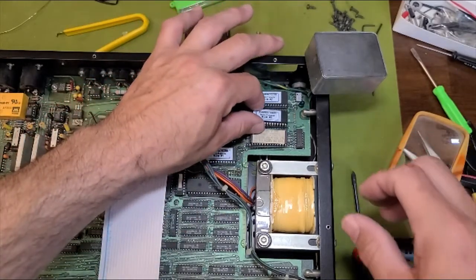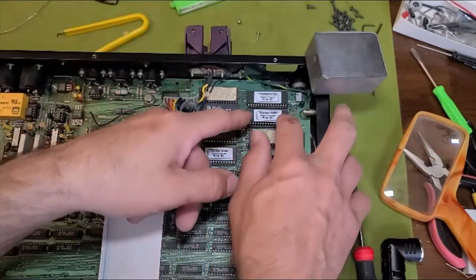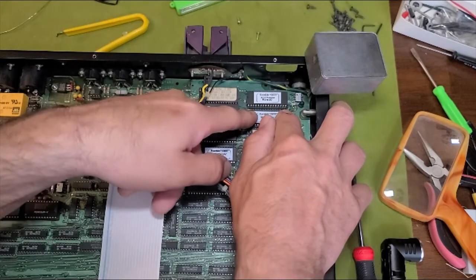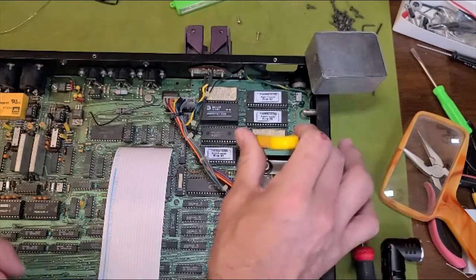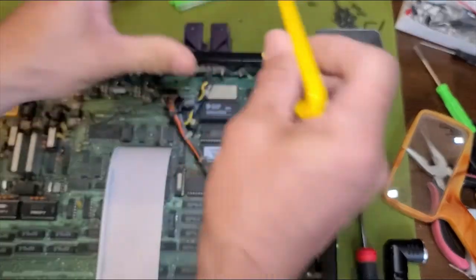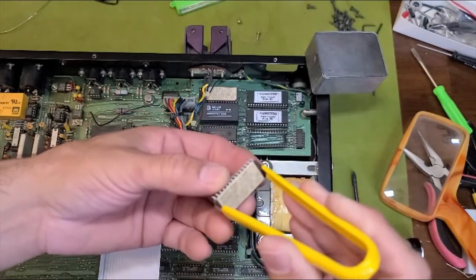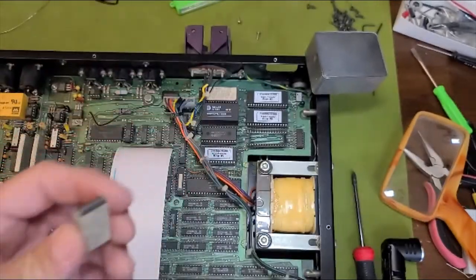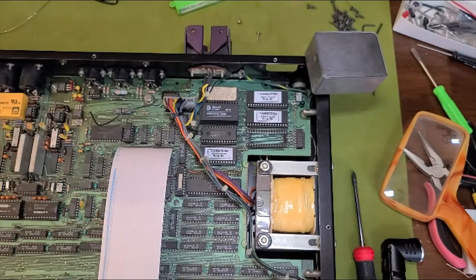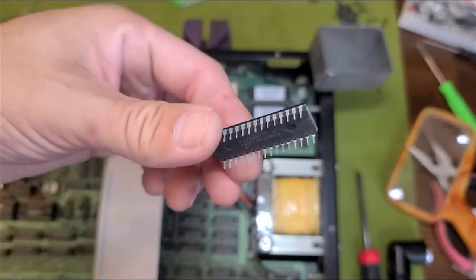It's a little tricky to get these in here. Luckily the pins are pretty good and straight, so I just got to line them up with the sockets, make sure everything's lined up, and then push them into place. Removing them — I don't have the good tools. I probably have them at the office, but they gave you this little cool tool here. It's a little bit of a brute force endeavor, but it does lift them up from the sides and then you're able to yank them out in a somewhat decent manner. But as you can see, it bends the snot out of the pins. Luckily I'm not using these again. Word of the wise: they do make a better tool for this, but I don't have it with me.